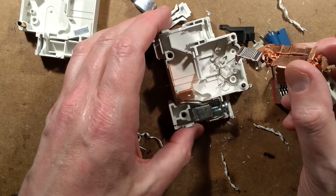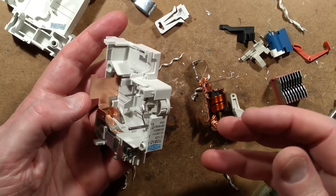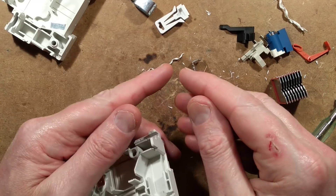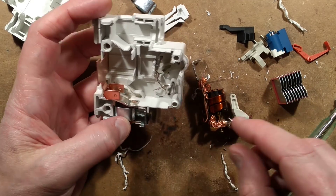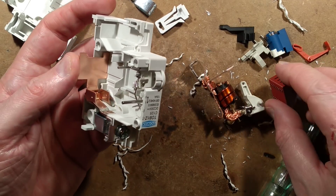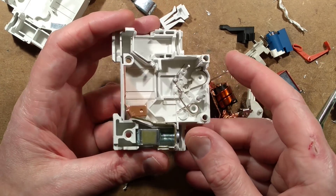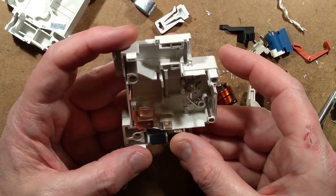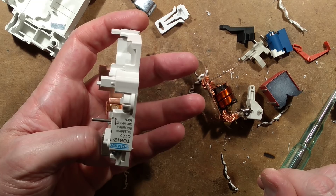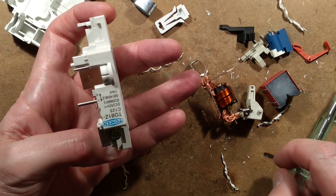Inside, I'd say it's less exciting than I was expecting. I thought there was going to be some amazing wide gap, or maybe multiple contacts in series to break that current. But it does appear to be purely using a larger quencher — and that's it. Which makes me wonder: is it really rated for DC? I'm not sure. Maybe others have opened DC breakers — I just would have expected something a bit more than this for 125 amps.